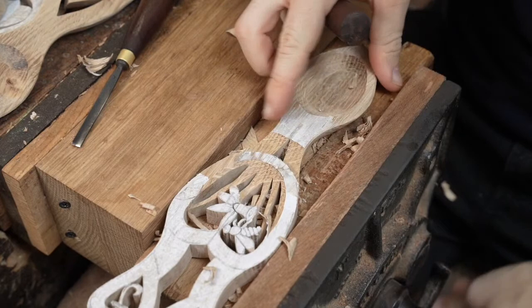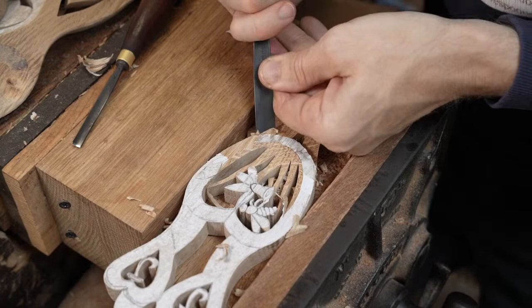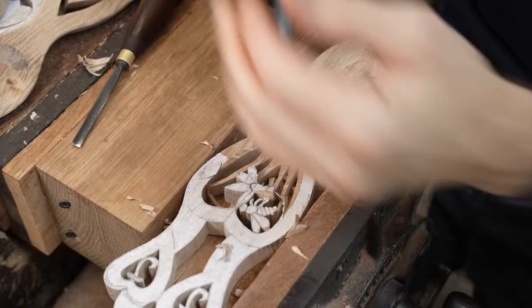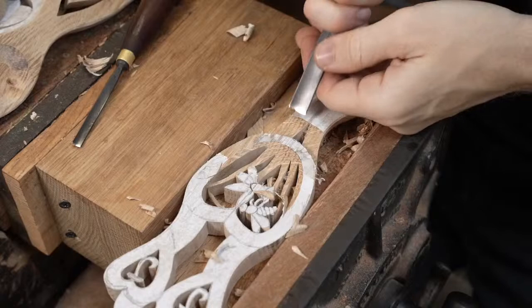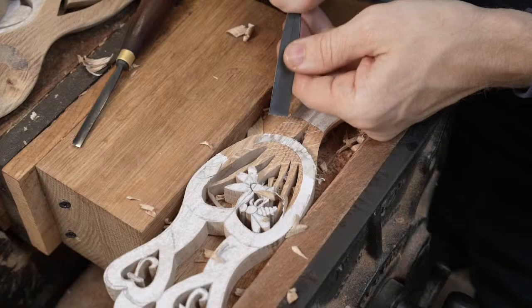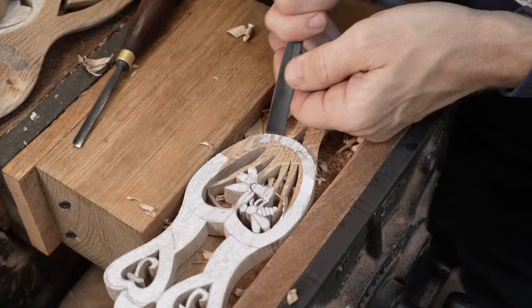And if you do have bits where the grain switches direction mid-cut and a chunk goes, yeah, that happens. Carve it deeper. There's also the other aspect where you'll be carving something, like mahogany is a good example. Some mahoganies I've carved actually carve backwards, so you have to forget everything you've ever learnt. If a piece of wood is tearing when you're carving it in a particular direction, try and carve it in different directions and see which way it carves best. Don't follow the textbooks too much, because they're great in theory and give you a good basis, but it's getting the cleanest cut possible.